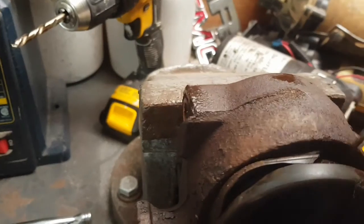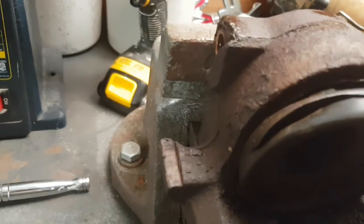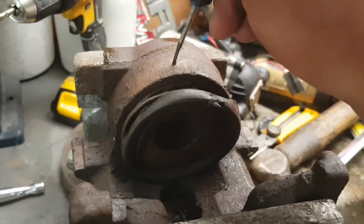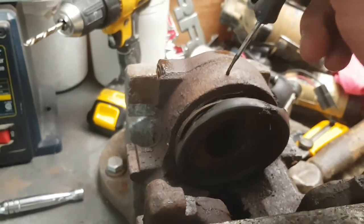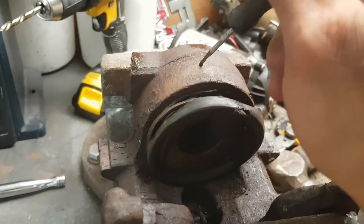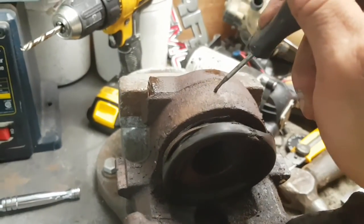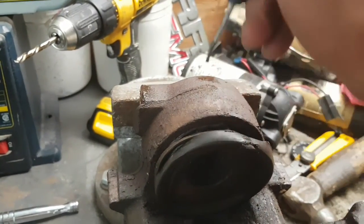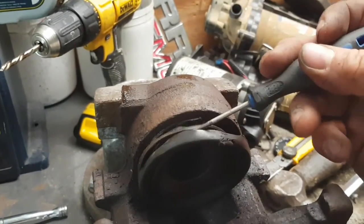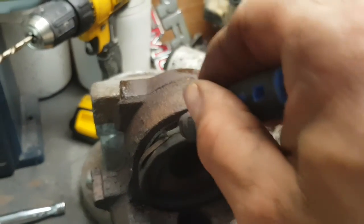But like I said, getting back to a couple ways of doing this. The way I used to do it back in the day was with compressed air. The problem with compressed air is this is brake fluid. And brake fluid is nasty, and you're going to turn it into a vapor, and then you're breathing it in, and it's getting in your eyes and whatnot. Not a very good idea unless you're fully covered, protected, mask on, face shield. Then, okay, fine. Because you don't want to be breathing this stuff in, vaporized and getting into your orifices and your eyeballs and whatnot.